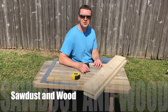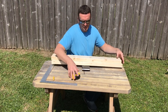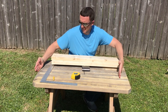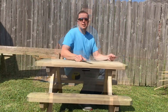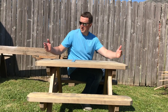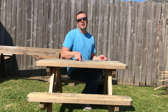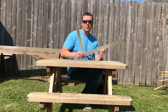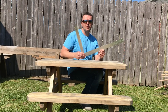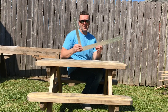Welcome to Sawdust and Wood. Today I'm going to go over how to measure, layout, and cut a gable roof rafter. We're going to measure this picnic table long ways, calculate a roof rafter to meet in the middle, and I'll show you how to do it. I'm going to show you how to make an 8/12 pitch roof using the step-off method with a framing square, which I prefer - I think everyone should know how to do this, even if you're going to use a book on rafter tables or the Roof Framer's Bible.